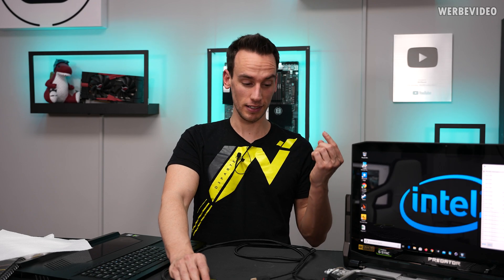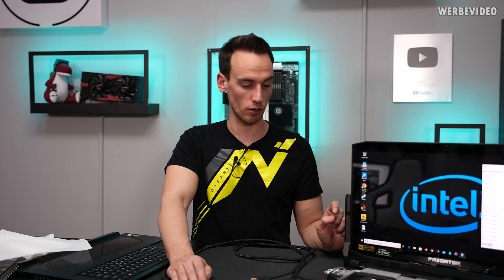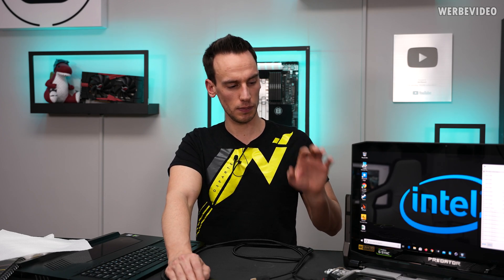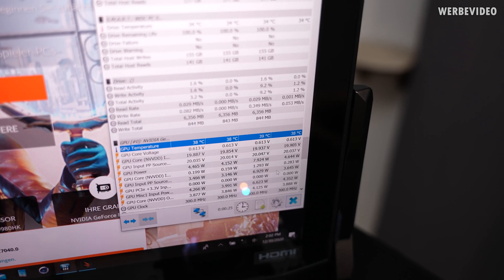Unfortunately I forgot to get my water cooling gear out of my old apartment, which means we have to divide this into a third part. It will take a few days until I can get access to my old apartment to get the water cooling equipment for the external loop. But there is still one thing we have to try — a 3D Mark run — because in the previous video we also tested 3D performance to get an idea of GPU temperature. I'll let it sit for 5 to 10 minutes to let the cooler cool down after R20 Multi. Previously, we had a peak GPU temperature of about 77 degrees Celsius and max performance in TimeSpy was 9000 points.